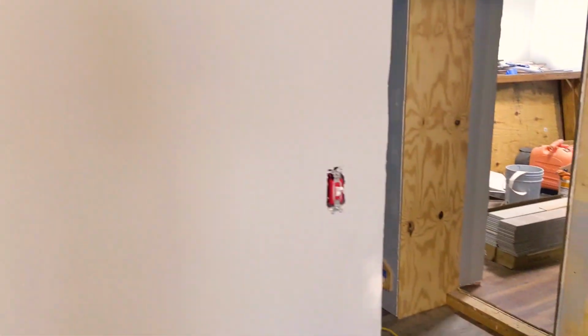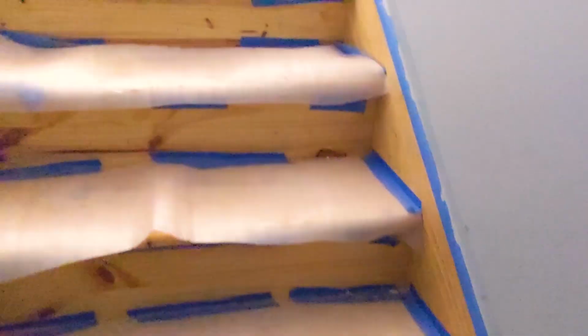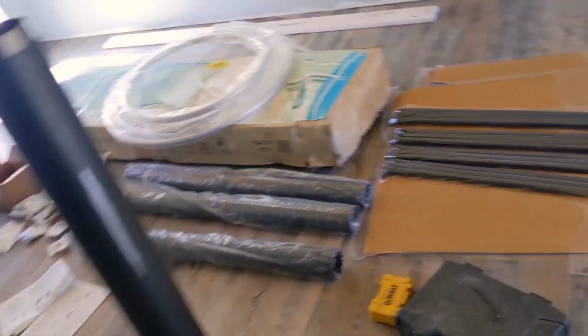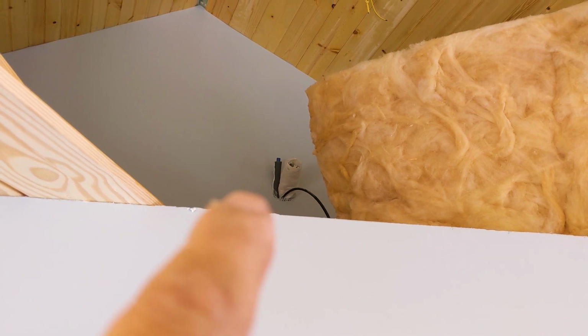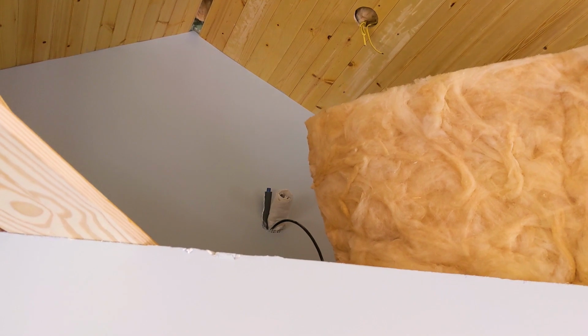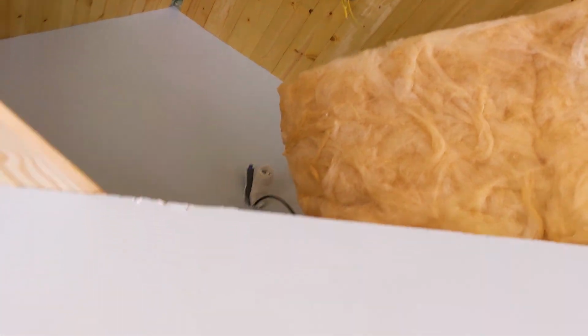And then we have a real challenging one. We're going to put the DIY MRCOOL 12K up here in this space, and we've got to manipulate that line set. I don't know if you can see it up there. There it is, and that goes all the way to the crawl space. We got the drains all the way out. Drains actually run all the way to the creek, so we get rid of the condensate. But it's going to be fun to pull those line sets through the walls, up and down to adjust.